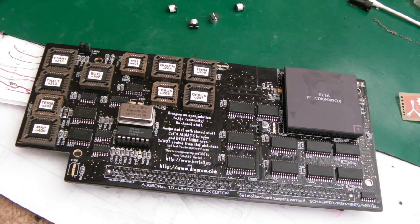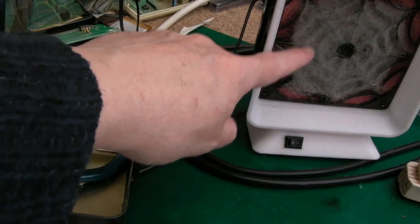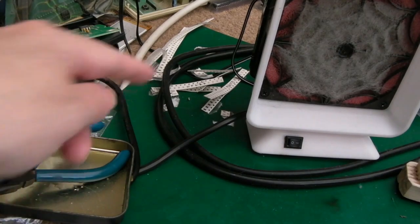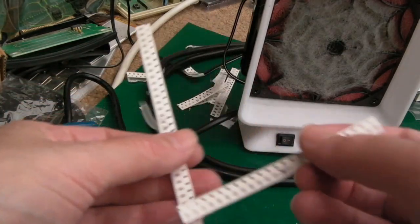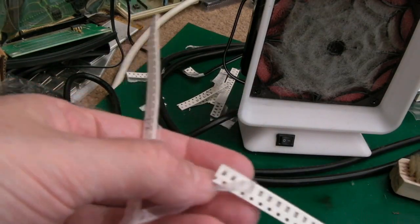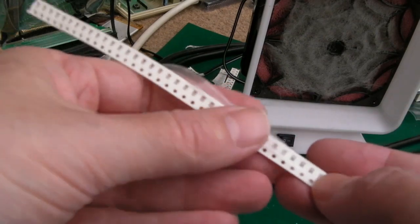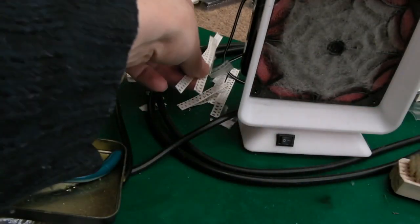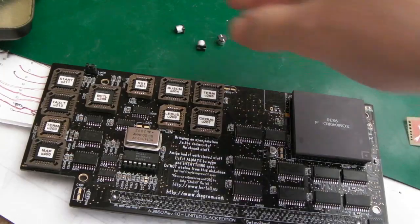Let's have the Pinball Illusions test run for about 10 minutes. Dead stable, booted first time — I'm confident all those sockets are okay now. I found in total about three pins I had to gently bend out a little bit, maybe half a millimetre. It was another Occam's razor situation — the three hours I spent was me chasing my own tail because those little bases were the issue. I am so looking forward to cleaning up because I've got stuff all over the place from the chaotic build — all the bits of SMD stuff left over, with lots of additional spares. Some components have three or four spares still — three 1K resistors, four 2K2 values. I need to sort all those and merge them with my components.